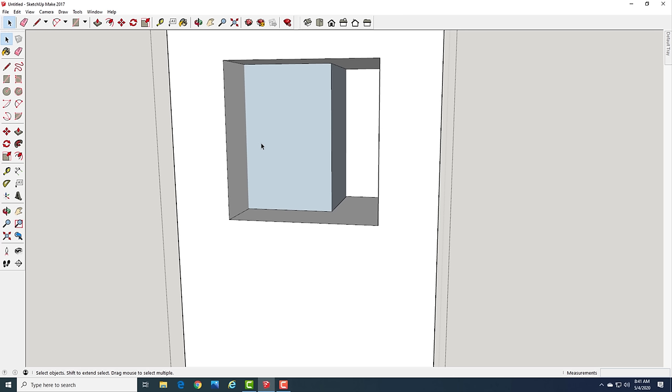If your mortises overlap like these do, you have to get rid of the artifact, the stuff that's kind of in between. If your mortises don't overlap, it's not a problem. In fact, a lot of times when you do things, you don't really want your mortises to overlap. But for a big bench like this with big mortises, with big rails, and I wanted them centered, they're going to overlap. All right, so let's do that.